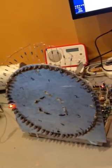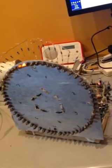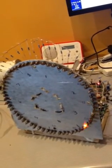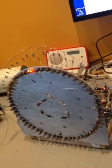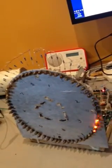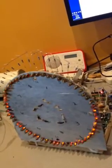Okay, so this is what the display looks like. This is how it'll look typically, counting seconds around the clock, which is pretty straightforward, and there are probably a few code bugs that need to be ironed out. Some people say, oh, interpreted language, BASIC chip, speed problems. I think you see from this though that there's not a speed problem really with the chip or with the I2C chips. I think it works at 100 kilohertz.